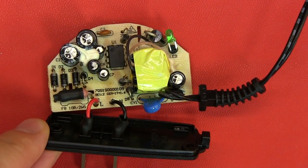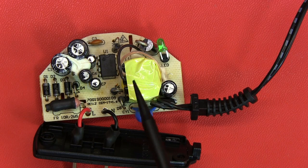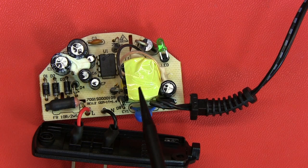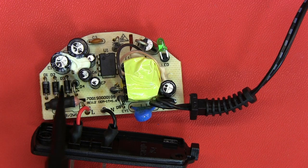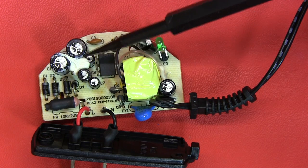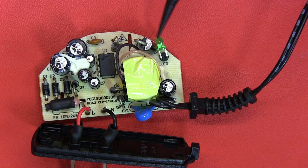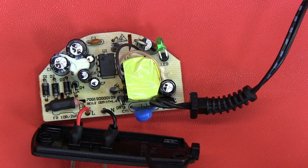What I'm going to try to do in this exercise is connect it up to the clipper and monitor the output stages to get a basic understanding of the operation. There are some basic things we can look at: there's a transformer which transforms the mains voltage coming in, the diodes over here appear to be a full wave rectifier, and there seems to be a fairly reasonable size power resistor over here. There are also some capacitors here for smoothing and for the operation of the IC itself, an LED to show it's in operation, and a fairly big diode.